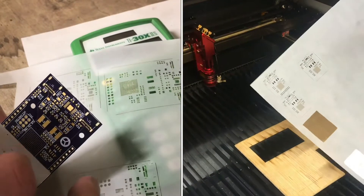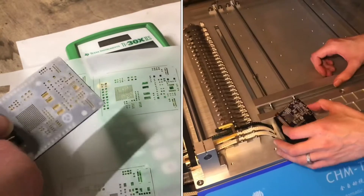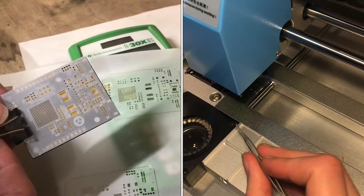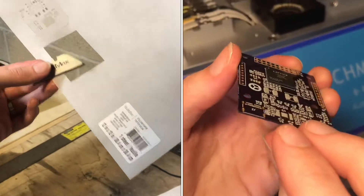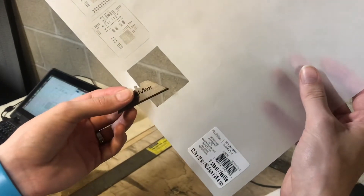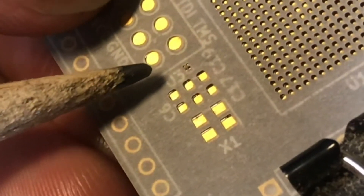If you're looking to create a solder mask for pretty cheap to get your solder paste on a PCB, we have found that a laser cutter can achieve very good resolution. We picked up a sheet of vellum paper at Michaels for about 79 cents — a very cheap material — and it seems the laser cutter just works really well with it. We can get quite precise.